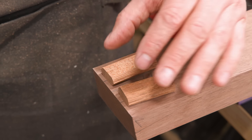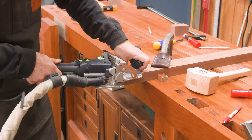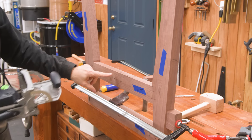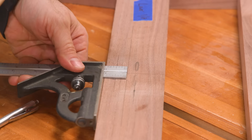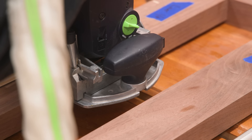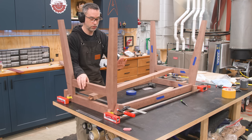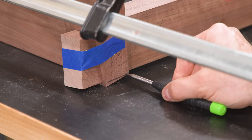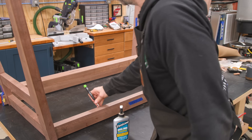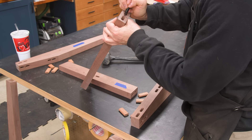Once I have the perfect fit, I can lay out for the dominoes. Unfortunately, the fence on the domino doesn't have enough capacity to make this cut, so I'll have to come up with a different way. I'll use a small piece of plywood scrap as a fence and cut the mortises on the flat. With the base upside down, I can make some marks at the top of the legs for a cut we're going to make later — these lines will protect me from making a dumb mistake. I can also make marks for the other details I'd like to add to the stretcher and the rails. After I disassemble, I'll carefully label my parts so I know where everything goes.